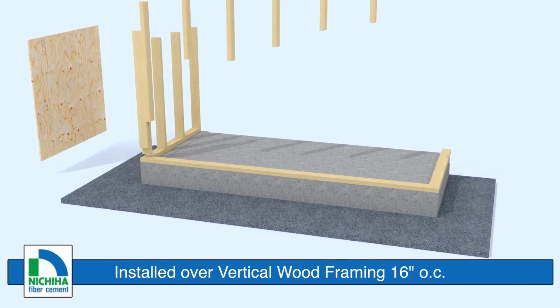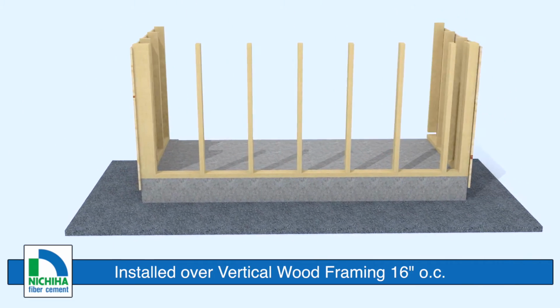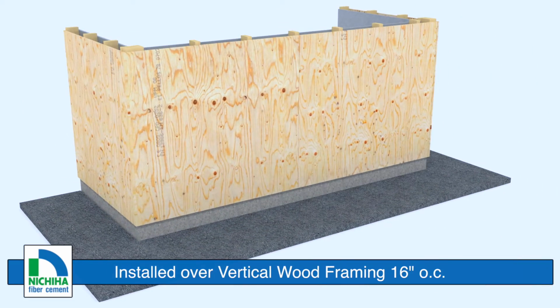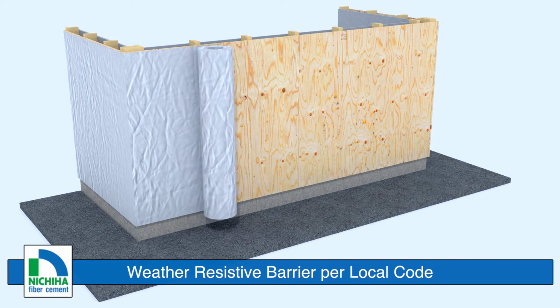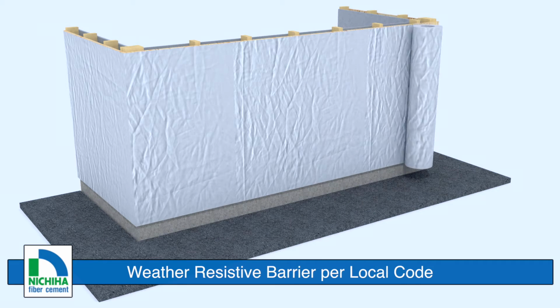Sierra Premium Shake must be installed over vertical wood framing spaced no greater than 16 inches on center with an APA-rated 7/16 inch minimum thickness plywood or OSB. A weather-resistive barrier is required in accordance with local building codes.